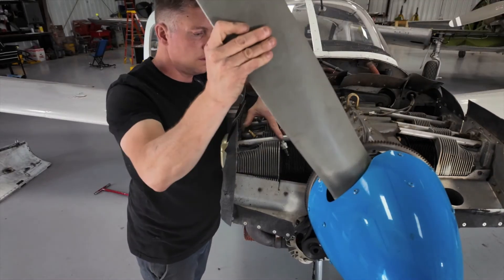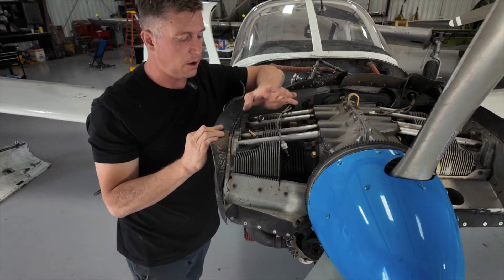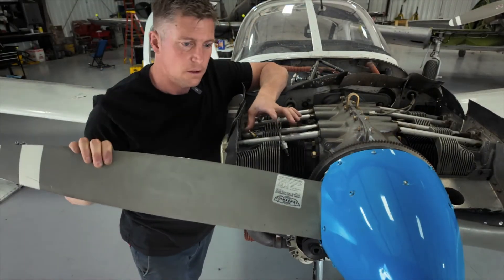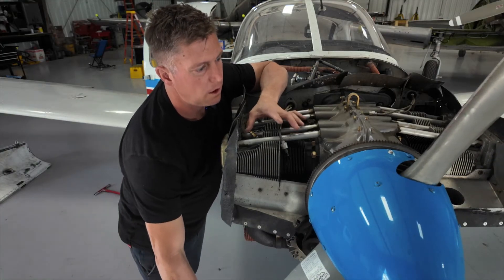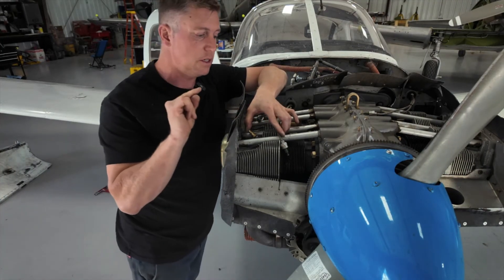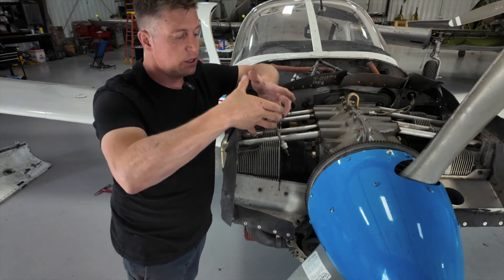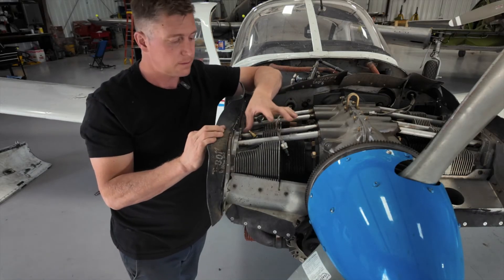When you're doing this, you'll be able to feel that it's either going to create suction or air pressure. You spin it and you can see there's a lot of air pressure coming out — right there is where you're going to have your top dead center. If you spin it some more it's going to have suction because the piston is traveling that way. The piston pushing up creates pressure in the cylinder, and once you get to top dead center it's just going to go one way or the other.